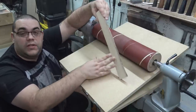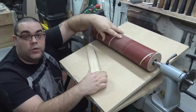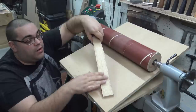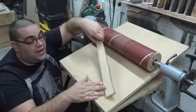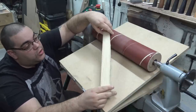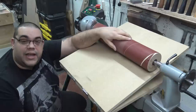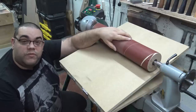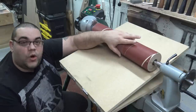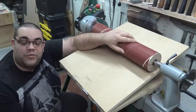Okay, so there we go — that is a really nice finish. This is 80-grit sandpaper — I went for that because I fully expect to have to sand by hand afterwards, but once the 80 grit's done its job of thickness removal of bulk material, it's quite easy to follow up with 120 and keep it flat. I can't really see any sanding marks on it, so I'm really pleased with that. This is a very easy, very simple, very quick lathe attachment for turning your lathe into a drum sander. I hope you've enjoyed this video and find it useful — let me know in the comments if you do anything different or if there are any improvements I can make. Don't forget to subscribe and I'll see you again soon. Bye for now.